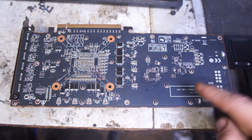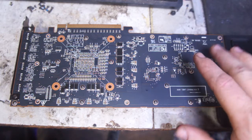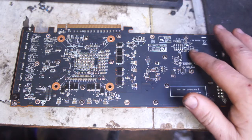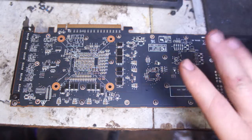If you only flashed one, it'll say that's not the same device that was there for POST and it won't want to initialize. It's the same firmware on both — there might be some extra stuff for whatever features the MI25 has over the WX9100. I'm pretty sure this FPGA here has something to do with this auto-switching.